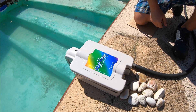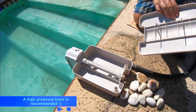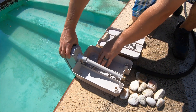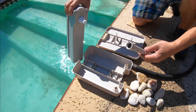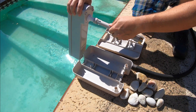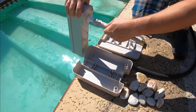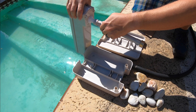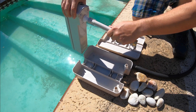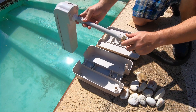When you pull it out of the box and open it up you got these parts here. First thing I like to do is go ahead and attach this part here — this applies the water to the actual autofill itself. Now there's a rubber gasket in here that'll bottom out, and you'll feel it start to bottom out. Don't over-torque this — pretty snug right there is all we need.